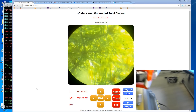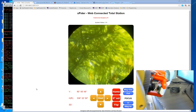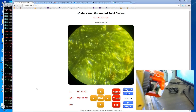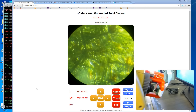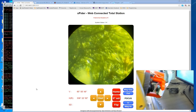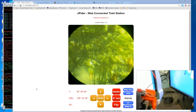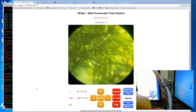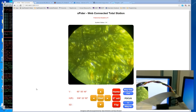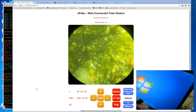There's also the Raspberry Pi camera — a small camera board connected via a white ribbon cable — which was very delicately designed. We went through many iterations of the 3D-printed optics mount to get that camera correctly aligned so we see a clear view through the optics including the crosshairs. The umbilical — the white ribbon cable plus smaller gauge wires — connects the limit switch, stepper motor, and camera all the way up with enough flexibility for range of motion into the Raspberry Pi.